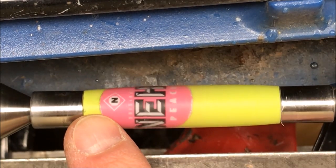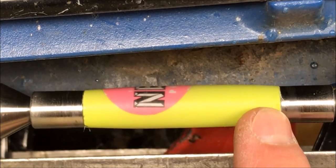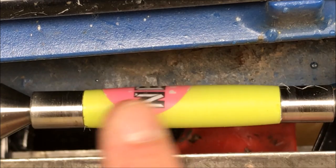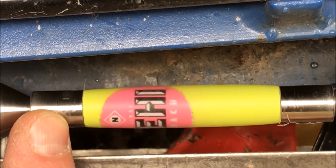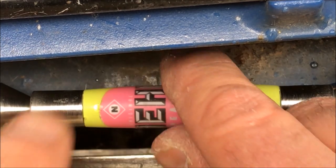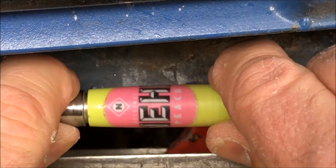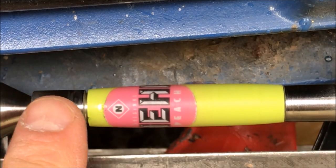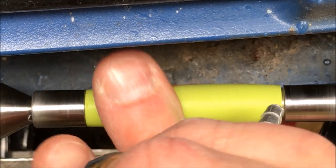I'm really happy — take a look right there, you don't see anything. It's pretty well hidden. There's a tiny little divot right there at the bushing, so I'm going to put just a drop of CA there and turn it away. At the top you can see a bubble stayed — and there's one right there and one there. They don't look too bad. I'm going to put just a little dot of CA in each of these areas, hit it with accelerator, and then immediately separate the bushing in an effort to keep from gluing my bushing to my blank.